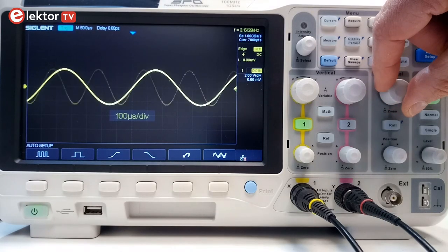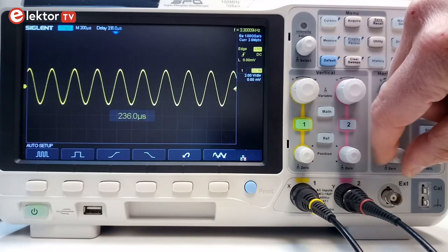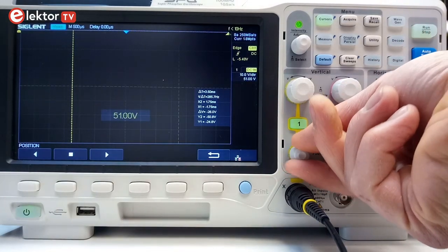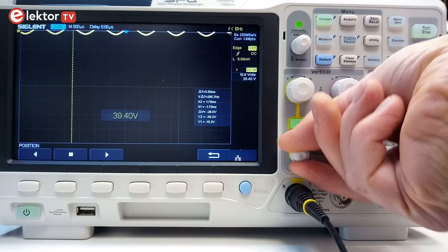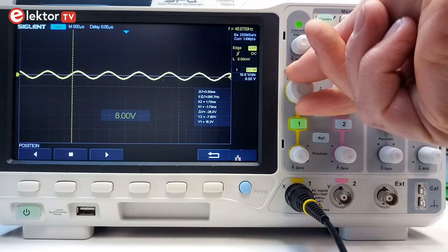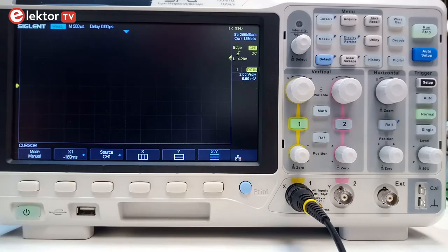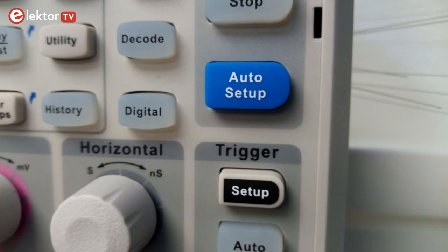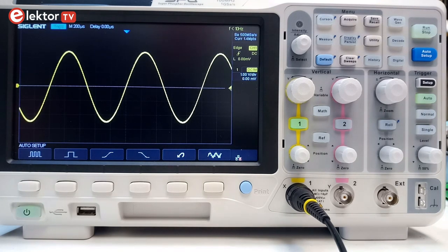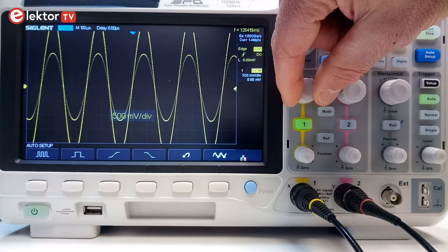With a knob in the section horizontal, you can zoom in and out on the timescale and you can move the signal to the left or to the right. Usually the center of the screen is zero. Up to now I was supposing that you did see something on the display of the oscilloscope, but maybe you didn't. One reason can be that the trace is not on the screen — use the vertical level control to find it. Another reason may be that the brightness is too low; if it is, crank it up. A third reason can be a trigger problem. If your oscilloscope has an auto setup button or something similar, now is a good time to press it. After doing so you may not see what you expected, but you should at least see something. Use the vertical and horizontal knobs to bring the signal into range.